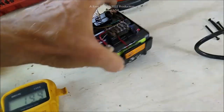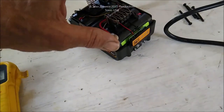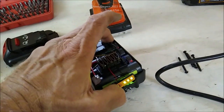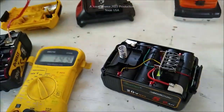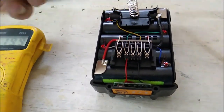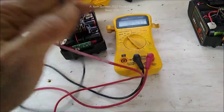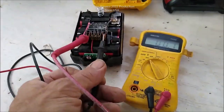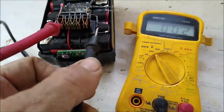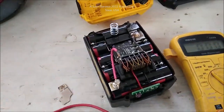This is what you need to be looking for. You can open a battery and see nothing crispy and assume it's dead, but maybe it isn't. This other battery is also showing 15 volts because the BMS balancing lines are feeding through — it's not picking up the broken set, so you're seeing partial voltage from the rest. Watch: I take that probe off and now it's missing a whole set of cells and all its amps, since nothing will carry through that 28-gauge wire. Thank goodness we didn't try running tools through it.